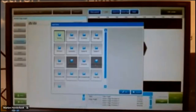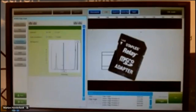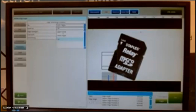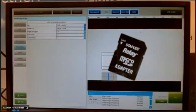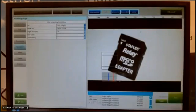Because I want to have a clear edge, I make it binary. It's quite easy. And then I have a very clear edge in this case. I go from left to right, and then I see automatically here the angle it is calculating. I'm going from light to dark in this case. This is the point in the middle of this area, and this is the point in the middle of this area. You see here also a small one, that is this letter, but that is not what I want to see. So I can play with the limit itself and also the strength.